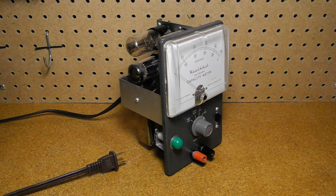Regarding safety, there is no fuse, but the unit is isolated from the AC line by the power transformer, so the unit is floating with respect to ground. There are no capacitors on the AC line, so no leakage current is likely. If I was to use the unit on a regular basis, I would make it a little safer by adding a fuse and a grounded three-prong cord.